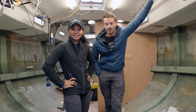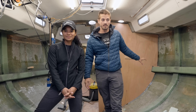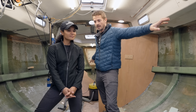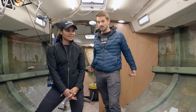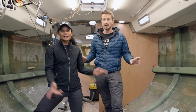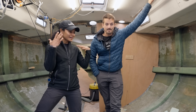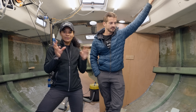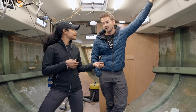We are going down the rabbit hole of gluing stuff back into our boat. Next steps are finishing the floor stringers and putting the main bulkhead in so that we can run two layers of glass throughout the entire hull. Then this full front section of the boat will be done with the main glass and reinforcement, and we can start working on cabinetry, secondary bulkheads, running all the plumbing and electrical, and installing equipment.